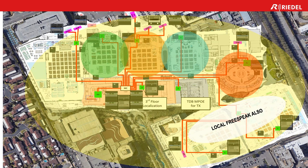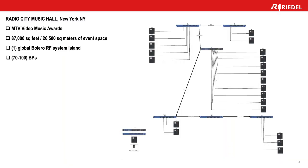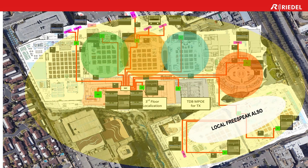So this is kind of the practical example that proves that you can have literally 100, 150 belt packs in that convention center that belong to different systems, and they can all coexist. I think last year was 100 belt packs, one conjoined system. You can pretty much walk anywhere in there. In this system, they had, I think, five unique systems, and one of those had antennas. Yeah, the yellow system had antennas dropped across the entire venue, including inside the zones of other systems.